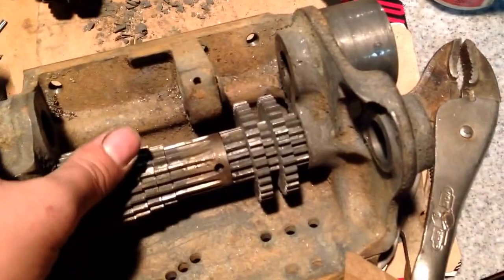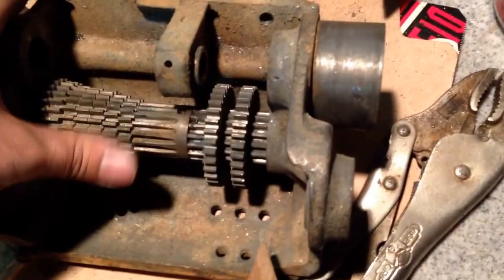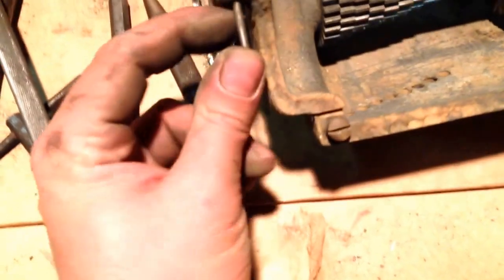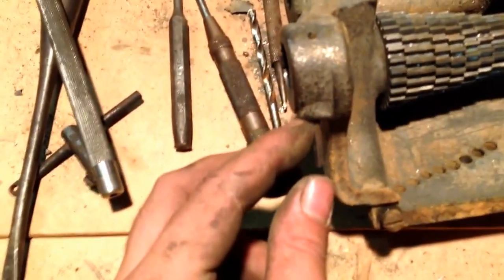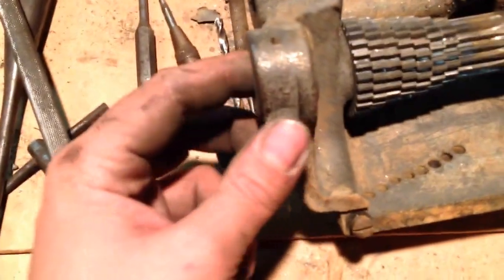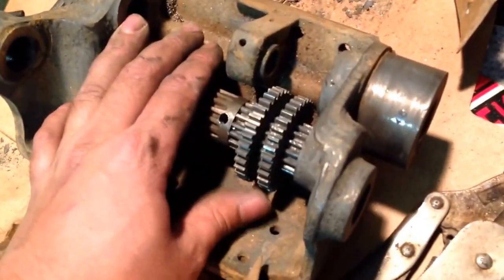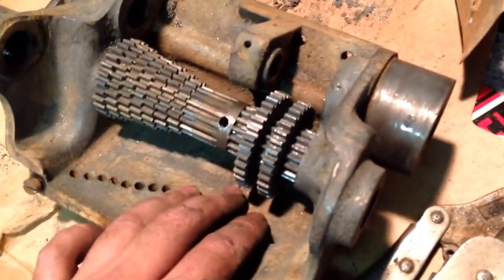The taper pins that were drilled out will be replaced with roll pins, just to make future work a little bit easier. You know, damn you South Bend for using these taper pins everywhere. Come on, guys. You could have done better. Funny enough, the first one that came out was the easiest one. Didn't take any effort. I believe that's a straight pin. I only knocked it out enough to where it cleared and I could get the shaft out. I'll leave that there for now while I get the rest of this apart, and then I'll try and get the tag off.